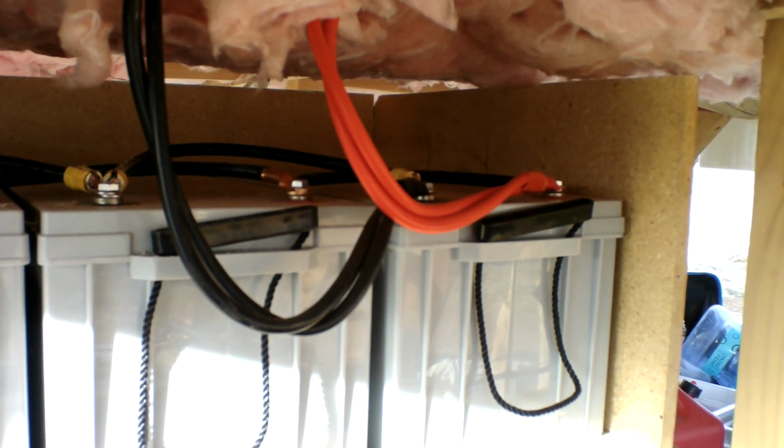Our old friend, the batteries, still running just as good as ever, regardless of the potentially faulty wiring. But here we go. I've got my ground wire attached onto my main negative terminal, and that runs out of the box and down through to the clip over there. So we are looking pretty good right now here on the batteries. Now just to bring it up to the inverter, and I think sure enough I probably am going to have to go to the hardware store just to get 4 of the solar panels so I can ground those out.